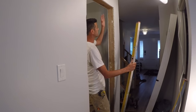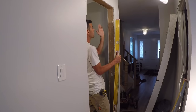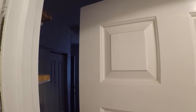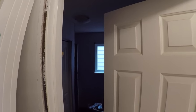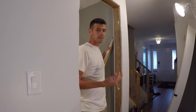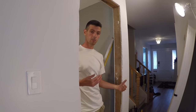Now that the door is cut I need to make a decision on how I'm going to install this because this wall is really out of level. If I install it with the wall being out of level I'll show you what can happen — this existing door has been installed with the wall, so let's find out what happens when I just let go. As you can see, it's got a mind of its own — gravity will take the door and it won't sit where you leave it. So you've got to install your door jambs plumb. These are just hollow core doors — once you get into solid core doors they do it even worse.